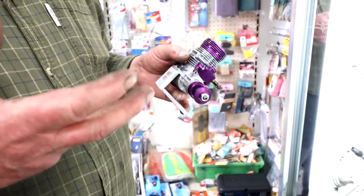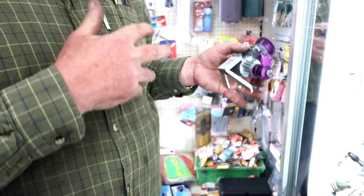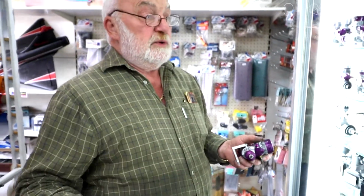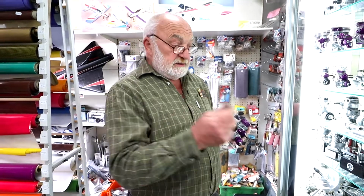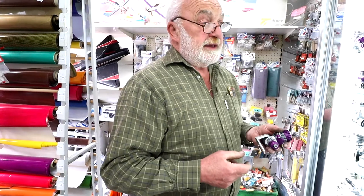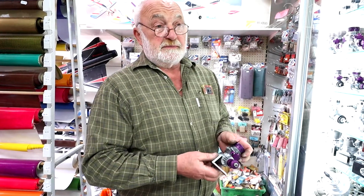Right. We always do 2 motors, a high RPM motor and a high torque motor, because OS, ENYA, whoever build a motor and say, here you are, do what you want with it. So if you're going to fly one of our Magnum or Velocity aeroplanes and put an 8.8 on it at 20 odd thousand, and then take that same motor and put it in a Hype and run it on a 13.4W at about 13,000, it's not going to work.